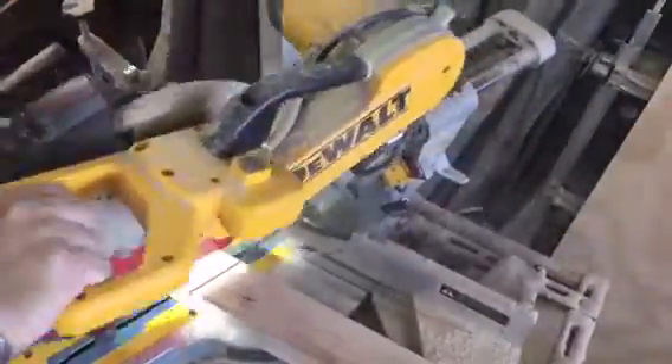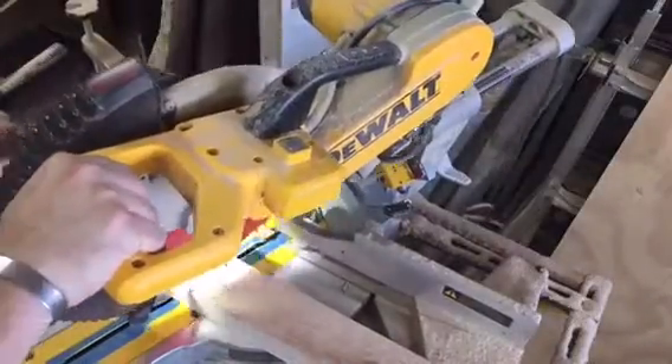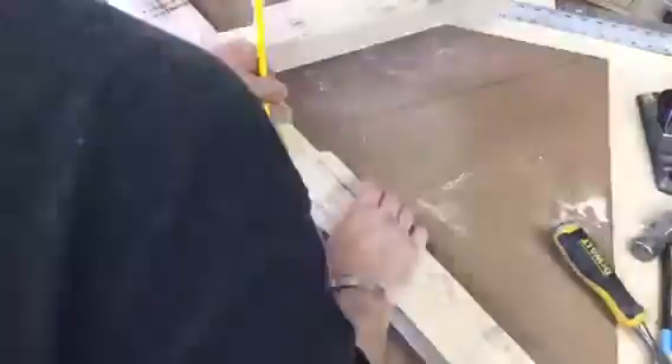At this point you'll start taking the waste out on the miter saw, breaking off the little pieces and sliding back and forth to get a nice smooth bottom. You'll test fit it and then glue it together for a nice seamless tight fit.